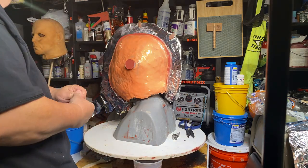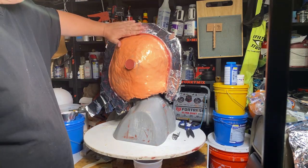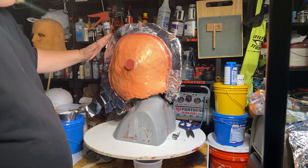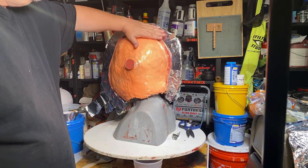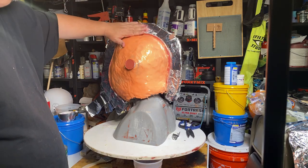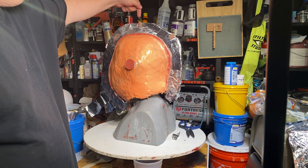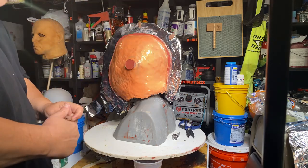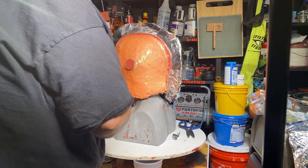Clay. And all that's doing is once I put the plastic up against here, the resin's only gonna go as high as this aluminum foil is now. And the clay will stick up just a little bit past that, and when that hardens, I'll be able to stick a screwdriver in there. Yeah, it'll mash the clay, I don't care. But I'll be able to pry this thing apart with ease. I shouldn't have too many problems with this.